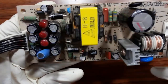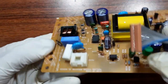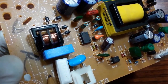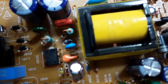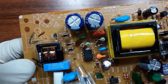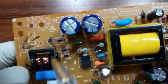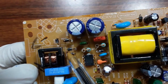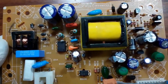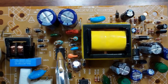Now here is the third board — the same working principle. The input is 230 volts. We have a fuse labeled R101, and here we have a varistor — this is for high-voltage protection. We have a capacitor and an inductor L for high-frequency elimination. There are four diodes for rectification, two electrolytic filtering capacitors, and an IC labeled IC101, which is the oscillator.